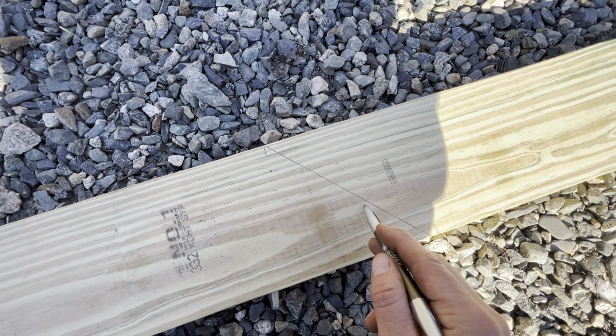On the house and stuff, I'll put another line down here for a rafter tail so you can put fascia board on it. But with this, it doesn't really matter. So the rafter tail is just, I'm not even gonna bother cutting it. So I'm gonna cut this up, walk it over and see if it fits. I hope so. It's always a big moment seeing if your rafters are, if you did everything right.